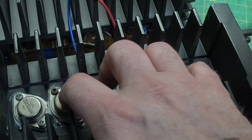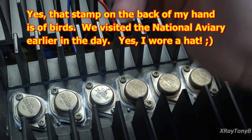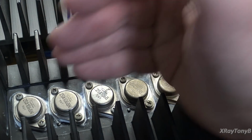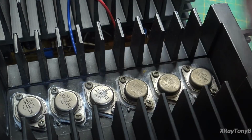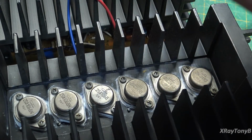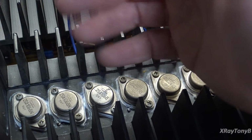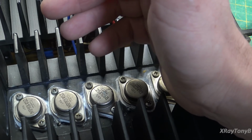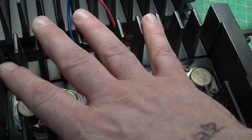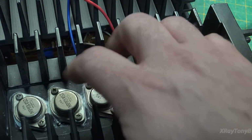And these transistors, because of their high frequency capability, it's much easier for a poorly designed circuit to go into self-oscillation. We call that parasitic oscillation. It's an oscillation that's a parasite on the circuit. And that parasitic oscillation is bad because it can run at very high power. And since it's above our audible frequency range, those oscillations can be up in the high megahertz range. And since it's in that RF range, you don't hear it, but it is actually causing the amplifier to run at levels way above the ratings of the transistors, and they burn up.